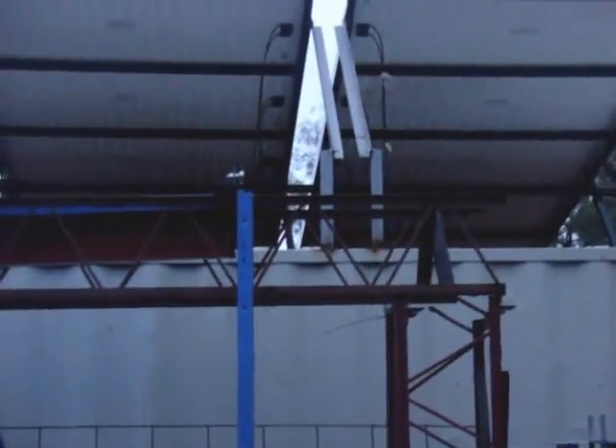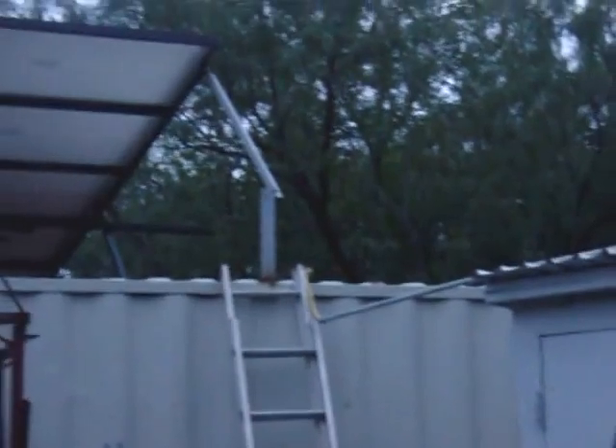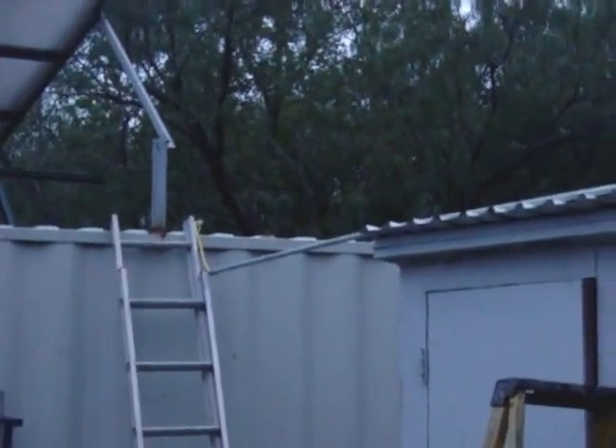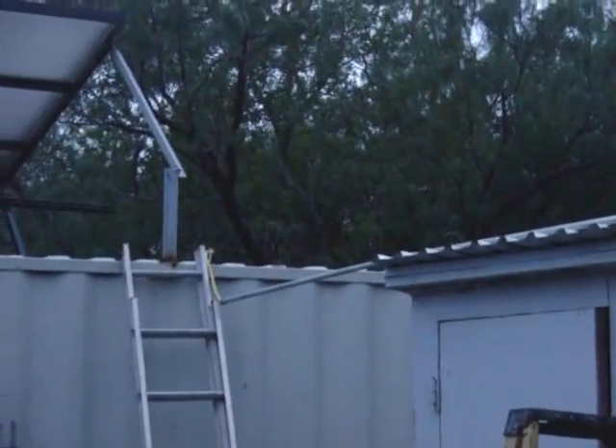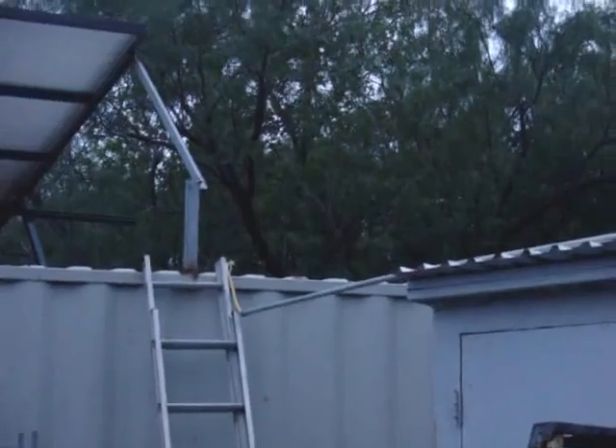I can pull it all through. Right now I've got to make the curve in a piece of conduit and get it over here, set up to where it's going to go to one box and the other box. The grid tie inverters are stackable on the AC side, which is a wonderful thing. I've got four wires coming in here and we're going to hook two of them up to one inverter and two up to the other, and ground both the neutrals — that should supply the system wonderfully.